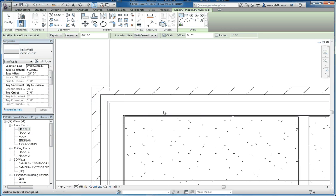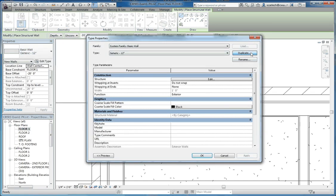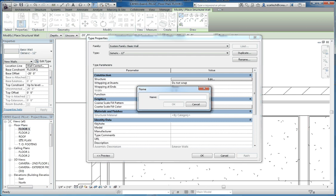We have a 6-inch core and we're going to go between that edge — that plane and surface of the structural boundary — and build that wall. It's going to start on the core face exterior and go out 12 inches so we can actually see it being built. If we made it go out only 6 inches, we wouldn't see it and there would be no confirmation. So we're going to go down to type, duplicate it like we've done before, and call it something similar — following the naming conventions we use, we'll call that Foundation Concrete 6 Inches. We'll keep it at 12 inches for now and come back to change the thickness later.